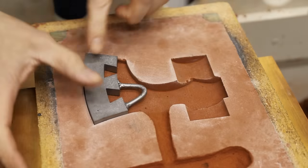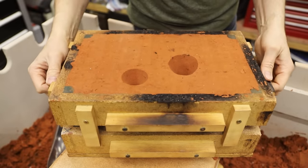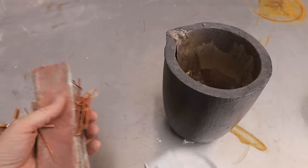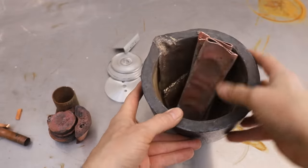I'm leaving this piece of steel inside the mold so that hopefully the aluminum bronze that I'm pouring in will flow right up next to it and lock it in place. Aluminum bronze is just an alloy of copper and aluminum, and in this case I'll be making it with 90% copper and 10% aluminum by weight.